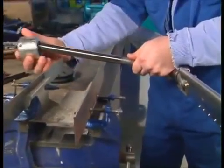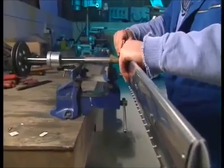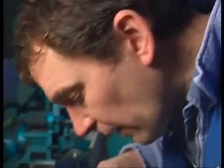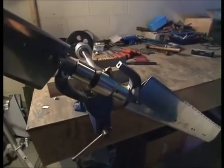The next job is to balance these blades. To do that I've set up a special jig in the vice which is completely level — I've set that up with the inclinometer — and I need to slot on the carriage slider assembly and the pulley, just to add a bit of weight on the end of the main rotor shaft. All I do is sit the shaft on the aluminium like so, make sure that both blades are right up against their bearing stops and that the whole thing is free to rotate. The point of balancing these blades is to stop vibration, because the tail rotor will spin at something like two and a half thousand revs — five times the main rotor speed. What happens is it drops down slightly on this side, which means this side is too heavy.